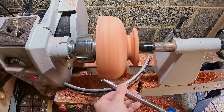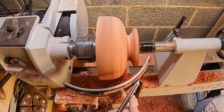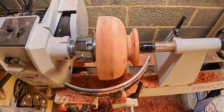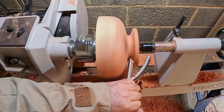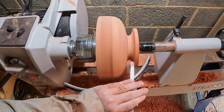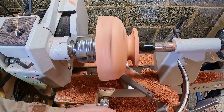I really wanted to end up with a sharp crisp angled cut, but I was running the risk of taking too much out and getting the bowl and pedestal all out of proportion. So with the pedestal more or less to shape, I concentrated on fine tuning the base and blending and fairing the upper section of the bowl to form a gentle curve from the cutout up into the side. To finish off, I used the carbide cutter to remove the heavier tool marks.